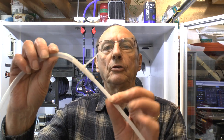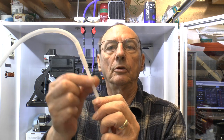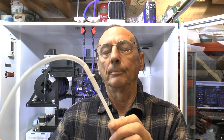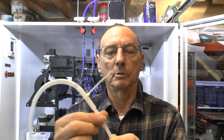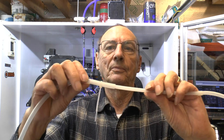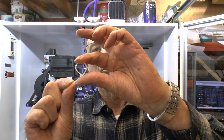Problem number one: I had a leak on the water pipes. I had this arrangement — some rigid or semi-rigid PTFE tubing and then flexible hose, about 8mm OD, and the other was 8mm ID or maybe 6mm. It wasn't a tight fit, and I thought if I put a cable tie around it that would be fine. Silly me — cable ties don't make a circle, no matter how you tighten them.